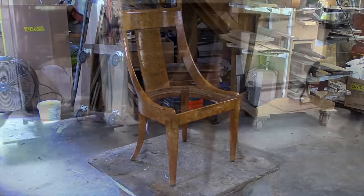Okay, this has dried for about 8 hours, and now I'm going to route this new piece down level with the next step. So I want to get this router bit set slightly lower than my second step there. Okay. Now I can glue down the next piece. Okay, now we do it again. Okay, I can remove my whole router setup now. I won't be using it anymore.